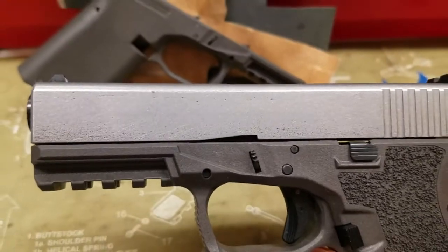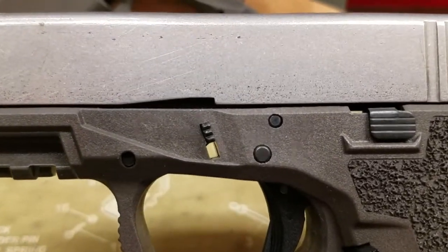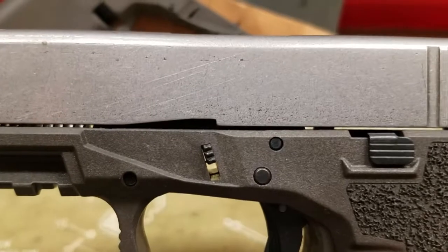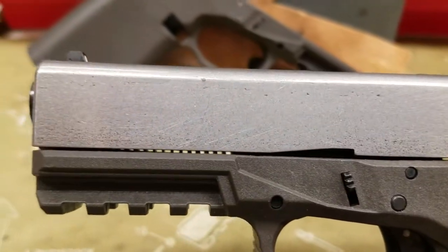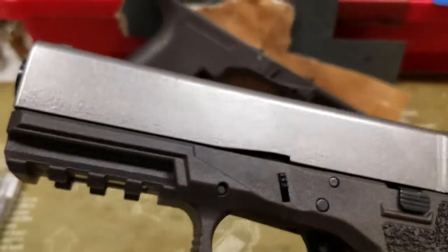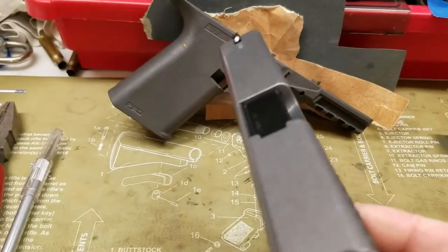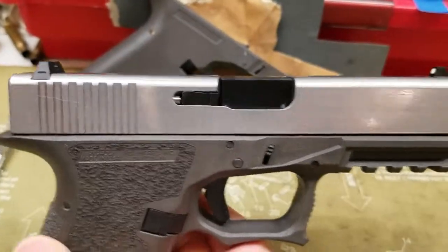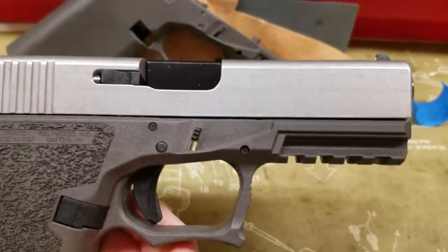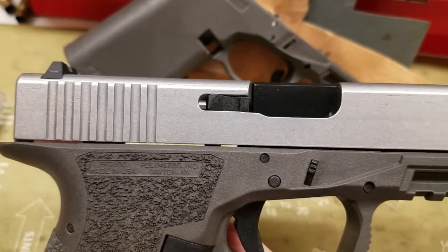Let's see if I can point out some of the blemishes on this slide. You can see what looks like dark pitting. When I go get some Duracoat products, they have something called Durafil, which is a coating you can fill in such imperfections, sand it down, and then paint over the top. Blemishes of this magnitude weren't really a big issue for me — main thing I just wanted to enjoy putting this together. Given the ability to fill in some imperfections, I think I'm going to give it a shot and see how it turns out.